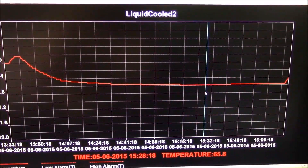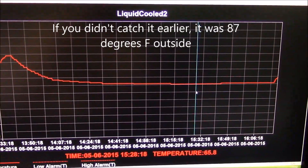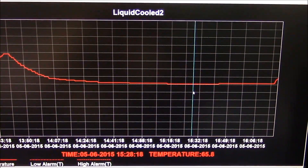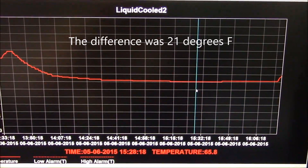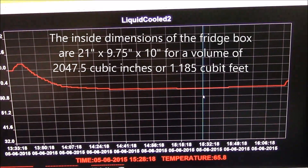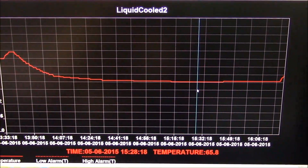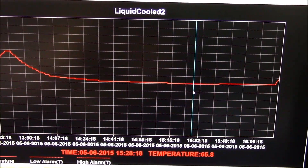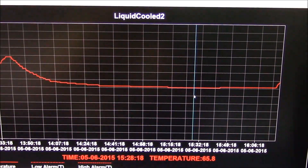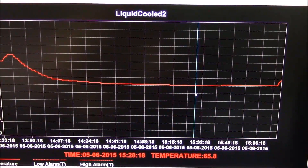It actually is higher than 80 degrees today. I will post the final ambient temperature and we can determine the difference between ambient and inside the box. I will also post the dimensions and inner volume of the refrigerator in the description so we can do some calculations. We'll order a stronger Peltier — it looks like this is going to move to a four-part series, because we've got to achieve about a 40 degree internal temperature. I'm guessing it's probably going to take at least a 15 amp Peltier. Stay tuned for part four in a couple weeks. Thanks for watching.